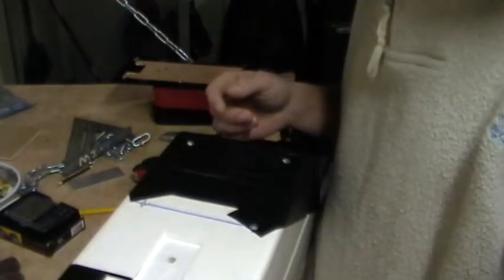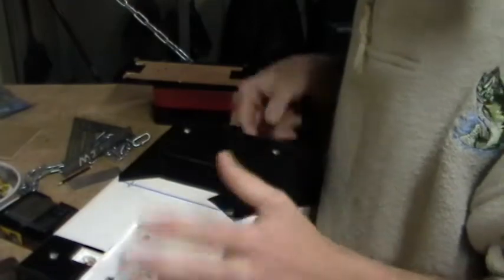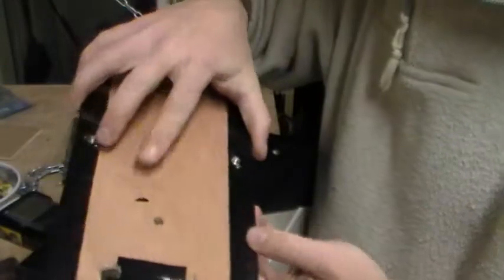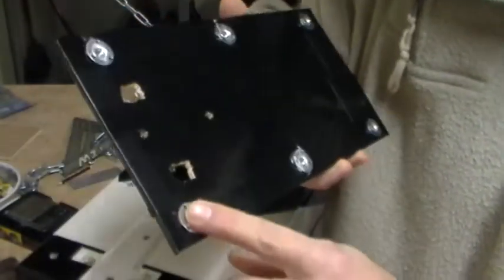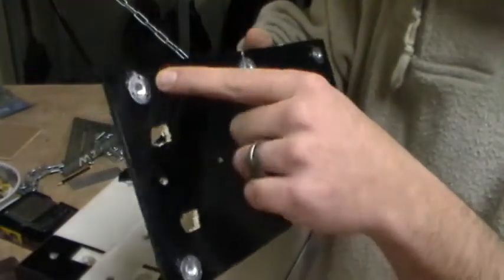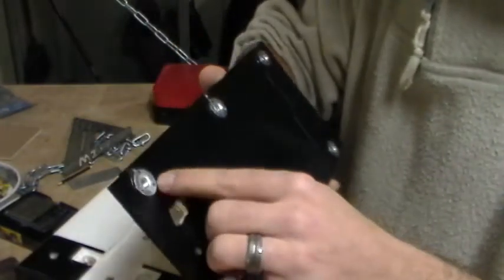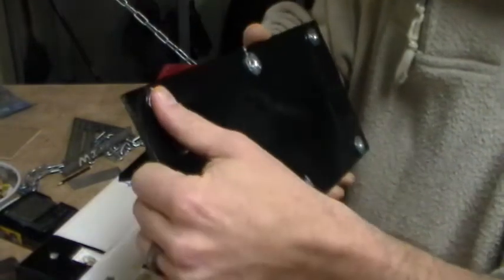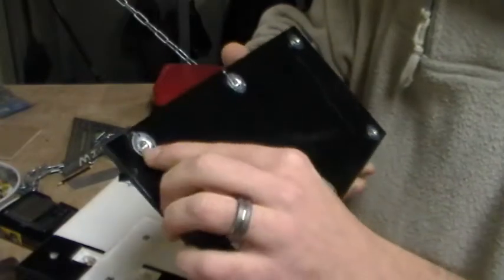One of the other suggestions I had gotten was to double up that plywood here on the inside. At first I wasn't going to, but the more I got thinking about it, I decided it'd probably be a better idea. I've got another piece of eighth inch plywood. Here are the blind nuts — I simply drilled a hole through where all the holes matched up. I put a little ring of hot glue around the outside of the hole and then smashed that blind nut in there, so the hot glue is holding onto the blind nut and coming up through the holes.